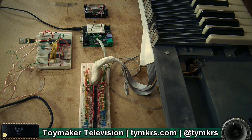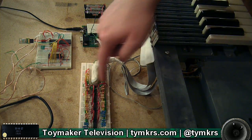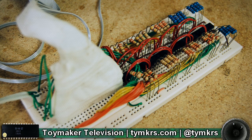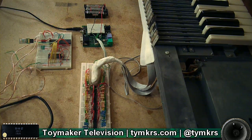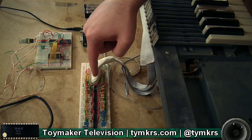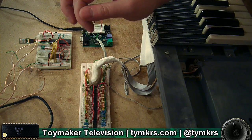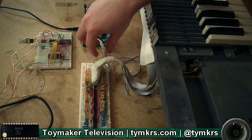So how's the sound getting there? What is this thing? This is what's scanning the keys to see which ones are pressed. So then, what are those chips in the middle there? Those are shift registers. Basically, they'll take a set of eight ones and zeros — switches, like on and offs — and they'll daisy chain up through and turn all of those ones and zeros into a stream of bits, which the microcontroller is pulling through this data cable here.